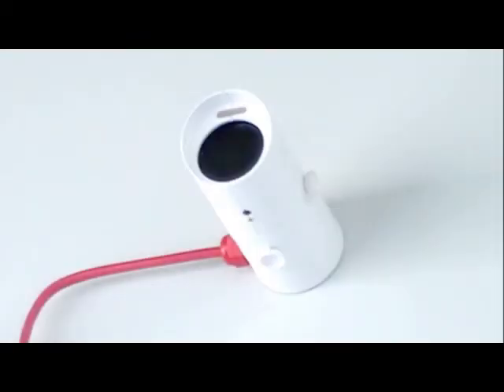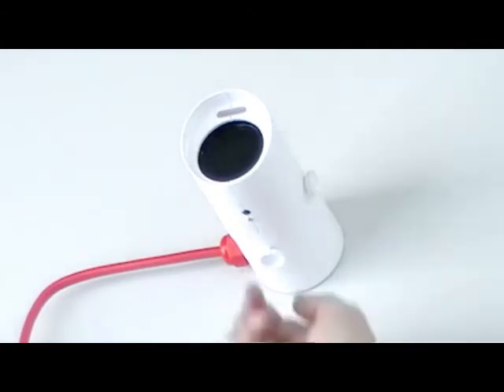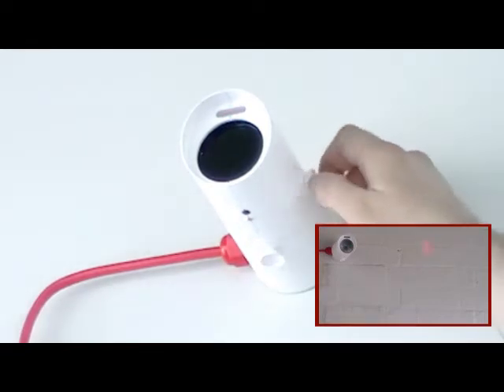We are going to use the thumb wheels to steer the laser in the receiver towards the transmitter. The laser is low powered and flashes only once per second. However, it is a sensible precaution to avoid looking directly into it. It is not essential to steer the laser perfectly onto the transmitter — within 15cm is all that is required. If you cannot see the laser, refer to troubleshooting.